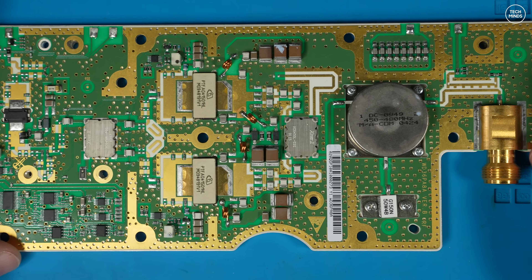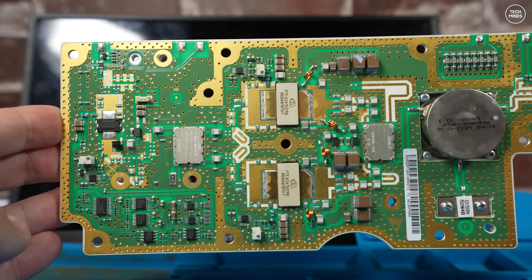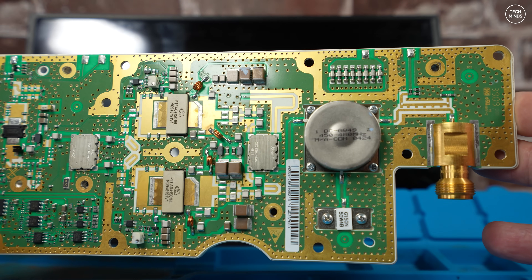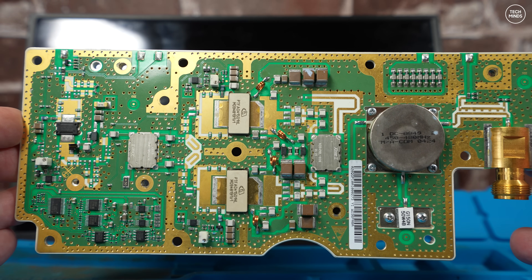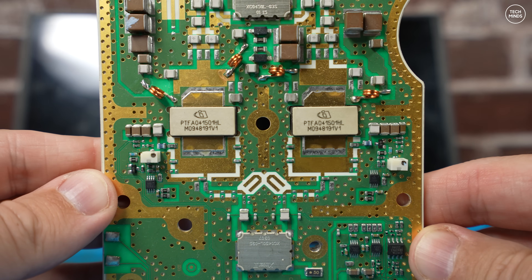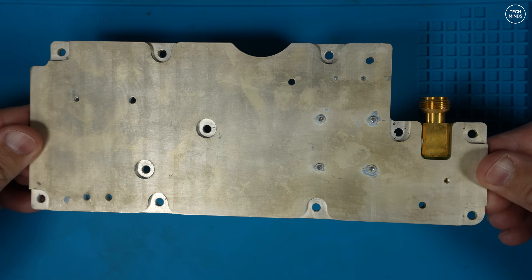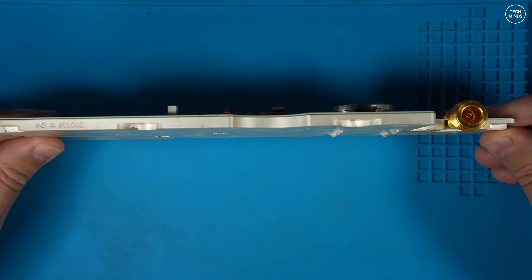This pallet is rated at around 350 watts, but for the frequency range we want to use after modification it should easily deliver 200 to 250 watts with around 40 to 100 milliwatts of drive. I primarily wanted to use this for DATV on 437 MHz, which is our DATV frequency here in the UK, but I've recently been thinking about EME — Earth-Moon-Earth. I'll park that idea until the amplifier is finished. The pallet is attached to its own metal heatsink but will need a huge heatsink to run at full power.